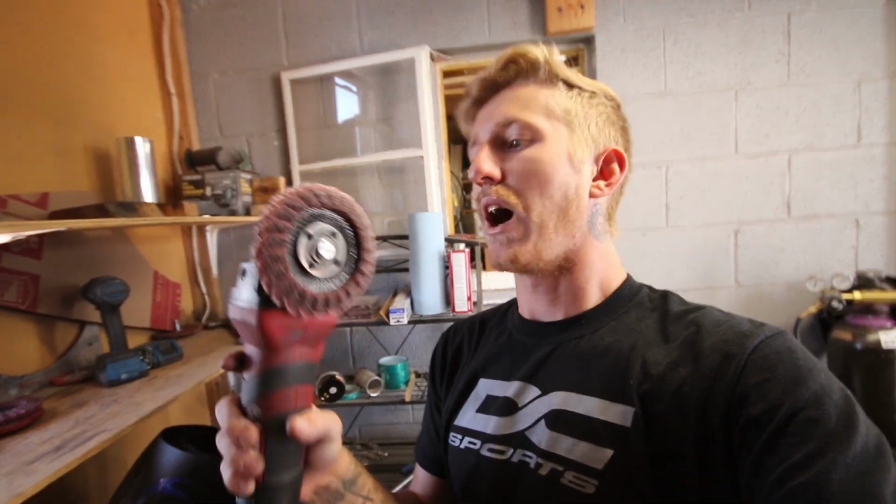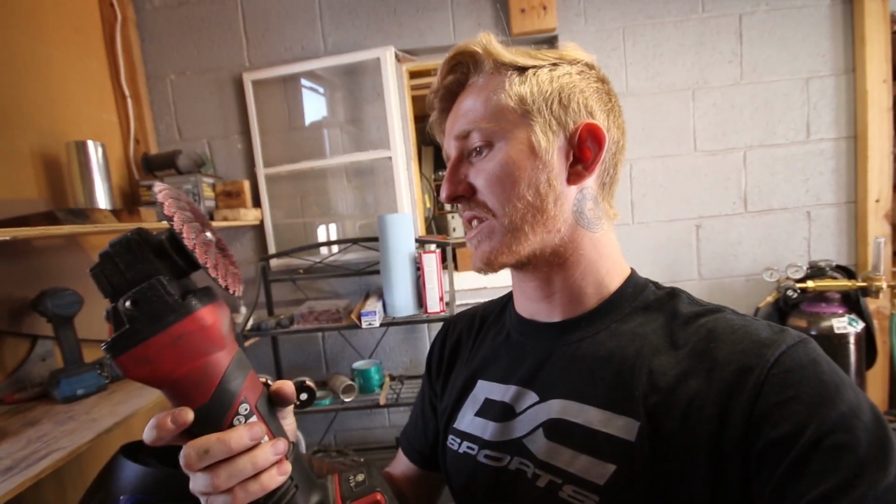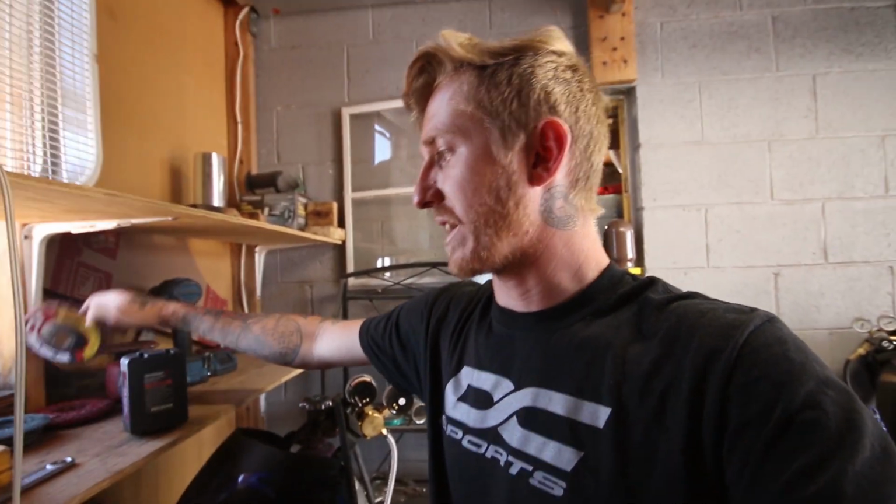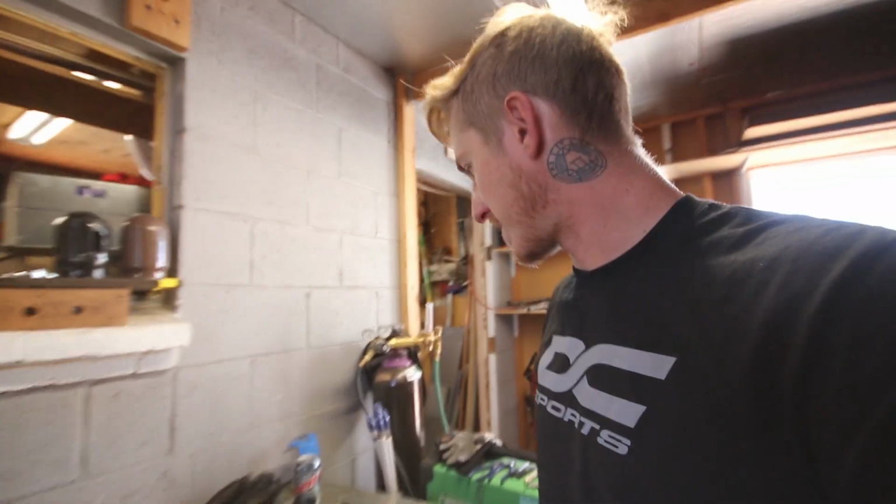Love you, Tommy. But if you see on here, I use a lot of flap discs, but one of the things that sucks is when you're using a flap disc, obviously it eats away at the material because it's sandpaper. So while I was standing in line at my metal supply shop the other day, I happened to find these Scotch-Brite discs. So it's just like a flat disc, but it's Scotch-Brite instead. So that way it doesn't eat away at the material.